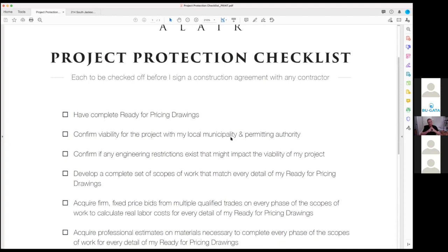Any of those sort of activities, you're going to be required to verify that you actually have real footings under your house. So somewhere in the permit process, the county is going to ask you to have an engineer certify that the foundation, the footings are good. And the only way to do that is to dig. And so you will be required to dig up some corner of your house. You can do it from the inside or the outside, but to verify how big the existing footings are and to make sure that you have an existing footing. So there's lots of those initial checks.